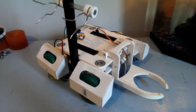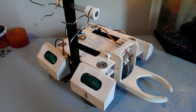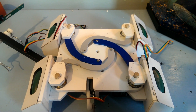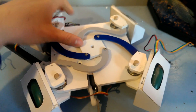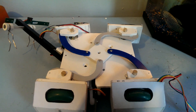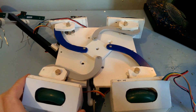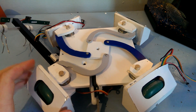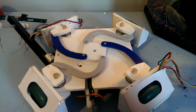To help, I've rebuilt the linkage system — here's version 2. The gears are now gone, which helped reduce the play in the whole system. One disadvantage of removing the gears is we can no longer put all four wheels at 45-degree angles at the same time. If this wheel and that wheel are at 45 degrees, these two wheels will be at 30 degrees — that's just a result of how the geometry works.